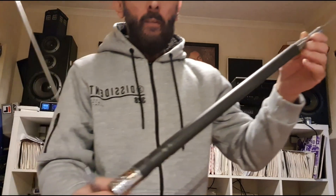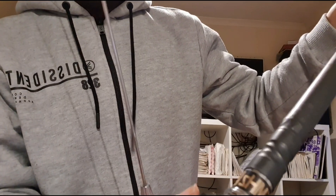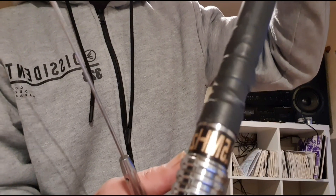I run these — it's difficult to get hold of these actually. These are Maldol. This is the biggest one I've got — this is the 80 meter Maldol, the 3.5 megahertz HFC 80. I'll just spin that around so you can read it. It's a beautiful antenna, works really well. I've had many good QSOs with this one, and as you can see, it's not too big. That's the total height — I'm just 5 foot 10, so it's probably about 1.3 meters.